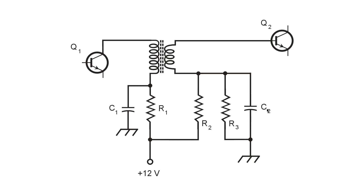As for the functions of these components: resistor R1 provides positive bias for the first stage at the collector, while C1 allows the signal to be at ground effectively at the base of this transformer — not at the top end, but at the bottom end. You may not need R1 and C1 depending upon the nature of the input circuits, but in general you will find these resistors.